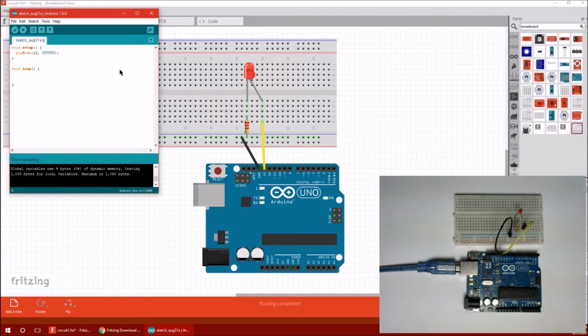So in order to send some voltage out of pin 13 to the LED, we are going to use the function called digitalWrite. One of the things I love about the Arduino platform is they use what's called camel case. See how there's no spaces? Instead, they put an uppercase letter where the new word starts. Another option that many programming languages use is an underscore instead. I find that very ugly. Computer programmers have a lot of weird opinions about things that don't matter.